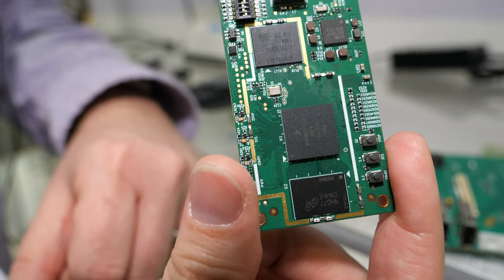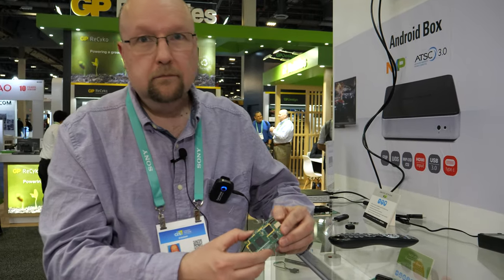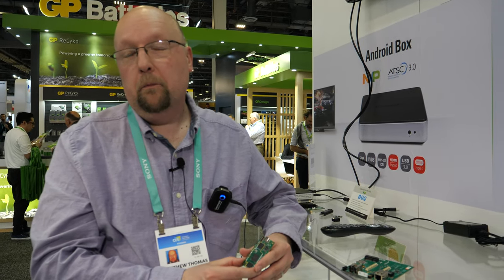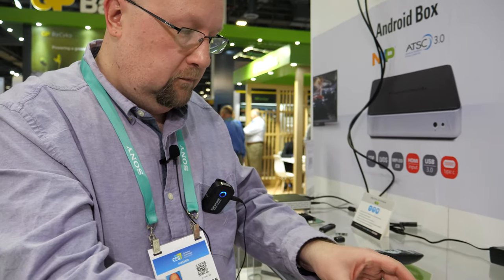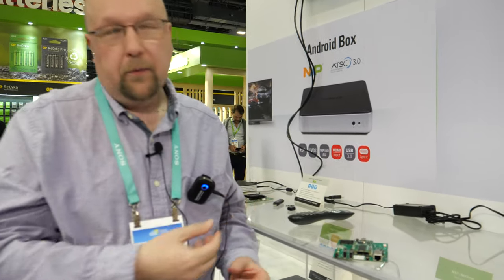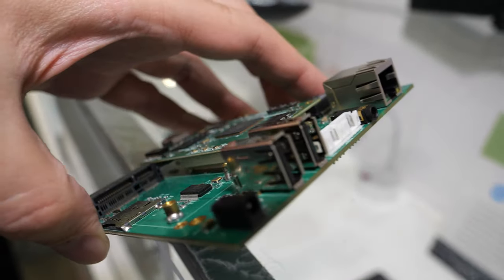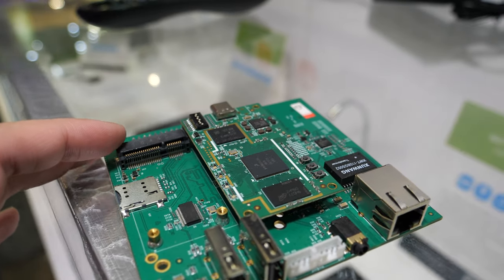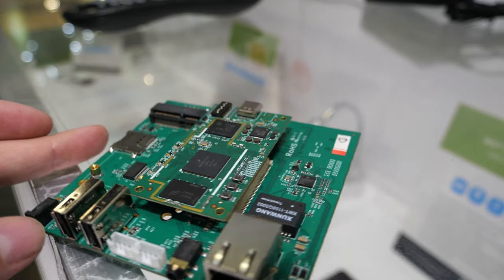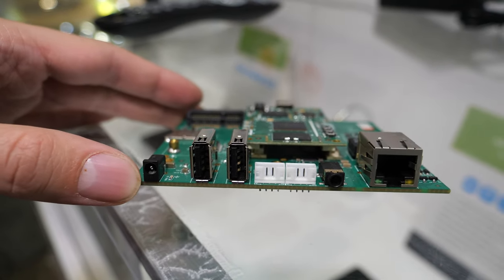It's an important new chip for NXP with long-term support, and they're eager to get into the industrial embedded world. This is a great choice for applications doing video processing, camera inputs, and things like that. There's also a PCIe mini slot so you can add other interfaces like a cellular radio, and a bunch of USB ports as well.